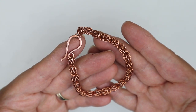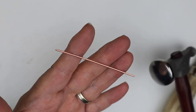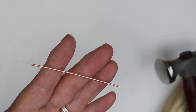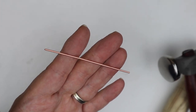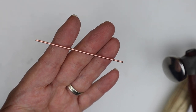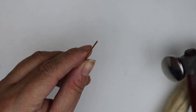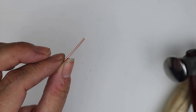To actually make this clasp we need a few tools. We're going to need a little piece of metal. In this case I've got three inches of 1.25 bare copper wire, and it works beautifully with bronze and stone and silver. If you hammer plated metal, sometimes you can take the plating off - it can fracture away - so just be careful with plated metal. But this 1.25 wire, when we flatten it out, goes into that lovely flat wider look.